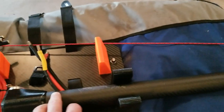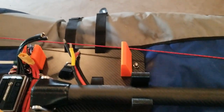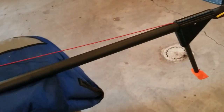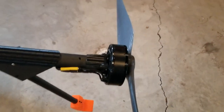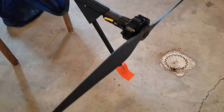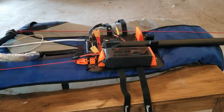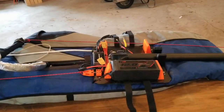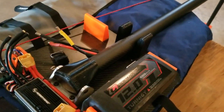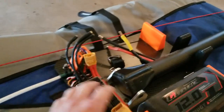Carbon fiber tube, the long one, was from AliExpress. It took months to get here but it's maybe a hundred bucks — that's probably one of the pricier things. The motor's pretty expensive; this motor is I think around $700, and the props are about $250 each. But all in, including batteries, maybe $1,500 to $2,000 is something you could make it for. Obviously if you don't make the parts yourself and you outsource them it's going to get a lot pricier, but there's a lot of different ways to design this. Really, all you need to do is hinge a tube, mount a motor, connect it to an ESC and some batteries, and get a throttle. It's actually quite easy.